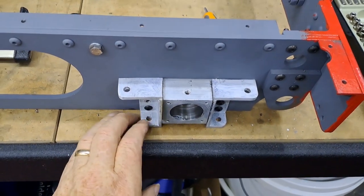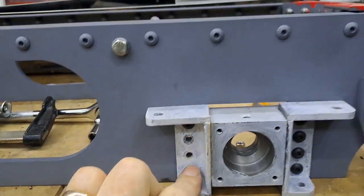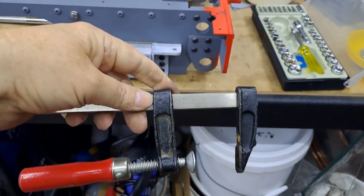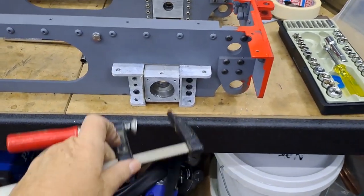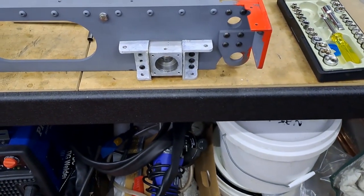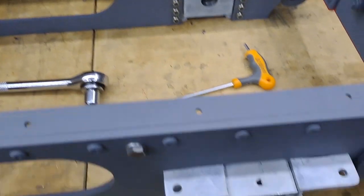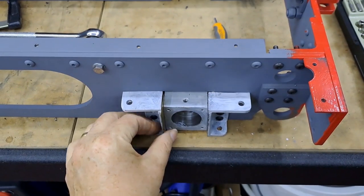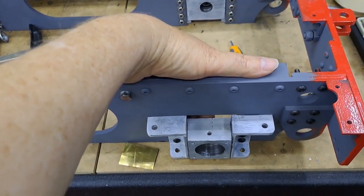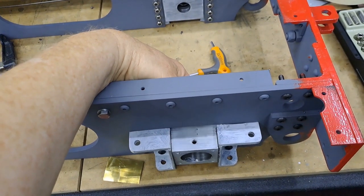It's not going to drop down. Got the first couple of bolts in - one at the bottom, one at the top. I'll put an F-clamp - I don't know what everybody else calls them, but this kind of clamp a guy called an F-clamp - put it across there when it was all ready to tighten up. Got this one in first, spread it out, put it on, tighten it up to hold it, get the first couple of bolts in, then took it out. As you just saw, it wasn't there when we started this video. Take out the shim - axle box in the right place, slides up and down nice and free.